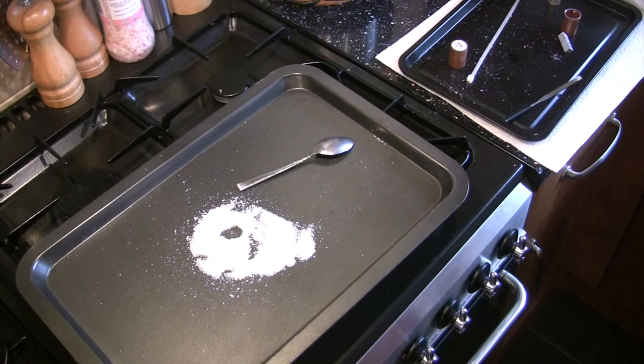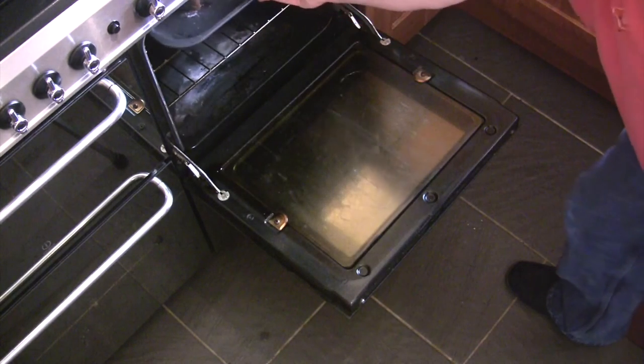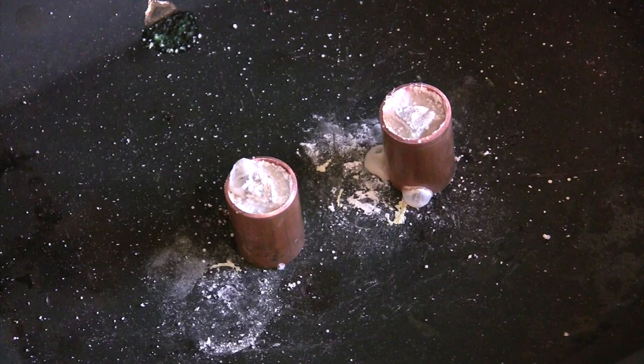On to the cooking phase. I simply put the cells in a chicken tray, put them in the oven, set the temperature, and cooked them. In the close-up you can see they're bubbling away — the moisture is evaporating and the chemicals are compacting down slightly. This is the crucial bit: you don't want the temperature too high or it bubbles up too much. I do want some porosity in the electrolyte, but not too much. Once cooked, the electrolyte is really, really hard. I started at a very low temperature and gently cranked it all the way up, then baked it for several hours.